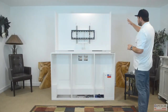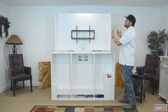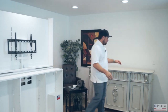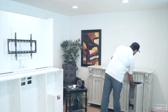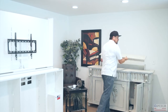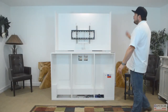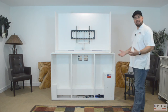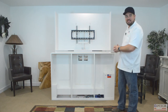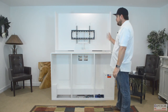There are alignment pins at the top designed so you can mount a finished top without a hinge system that would dump everything off the cabinet onto the floor. Everything rides up with it. The pins allow alignment left and right, but the lid will lift right off. It's all about saving time. When doing a TV lift there are all kinds of calculations to make sure the TV fits — not too much wasted space, and definitely not too small. We do all those calculations for you in five-inch increments, starting at 40 inches and going up.